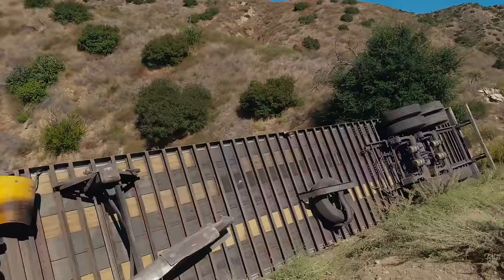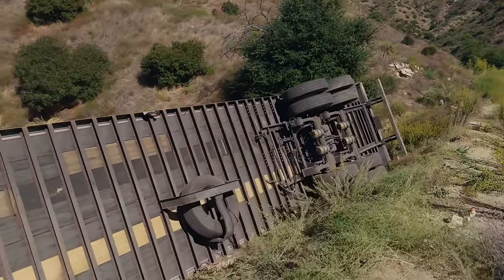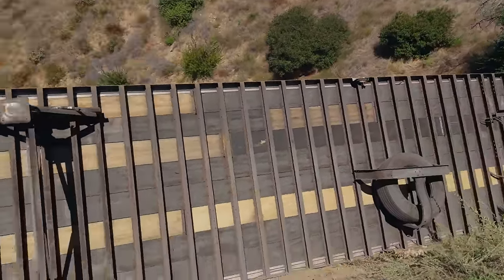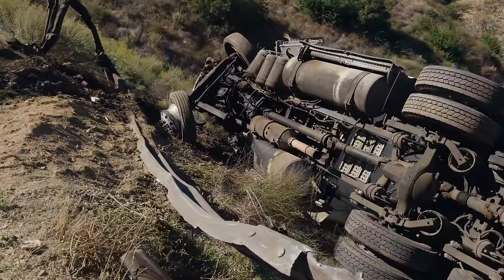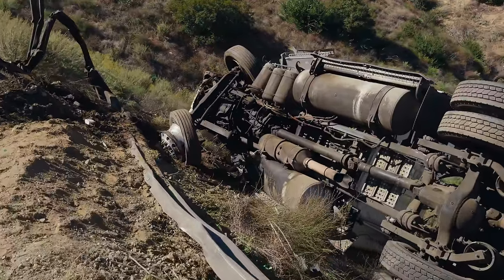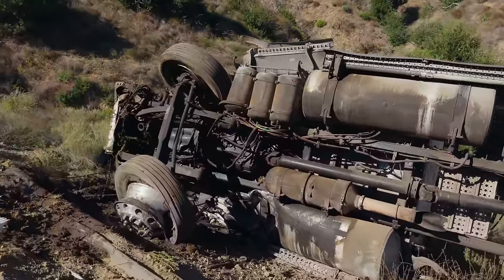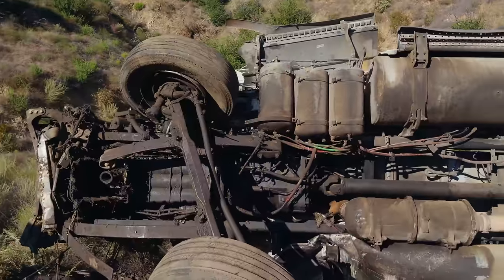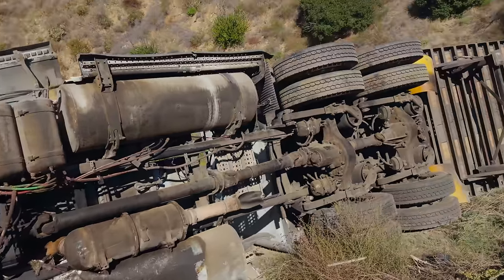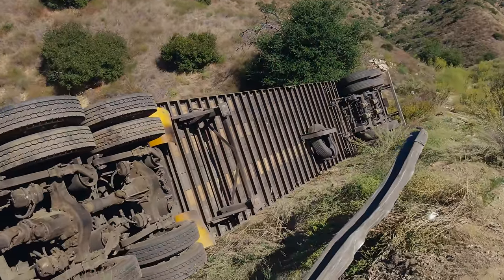They teach you in rigging classes that whatever the load is, when you're at a hill and an incline, you add X percent, and then if it's on dirt like this, you just keep adding multipliers. So we're gonna be pulling like 1.75 times what this actually weighs, is what a truck is gonna feel. But let me get up there and I guess we'll start bringing our rigging down.